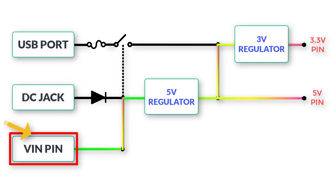The second method to power the Arduino is using the VIN pin. The voltage requirement for the VIN pin is the same as with the DC jack, because the VIN pin is connected to the 5-volt regulator. However, one thing you must keep in mind: it does not have any reverse polarity protection because there is no protection diode, so always make sure to connect positive voltage to the VIN pin.